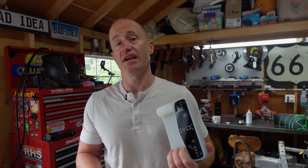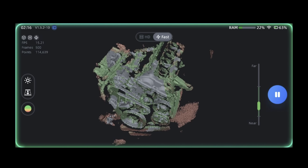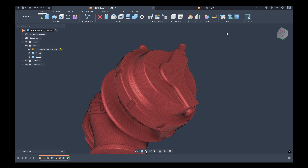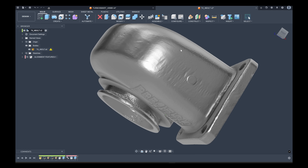The place where the Vega absolutely excels is in its sheer convenience and ease of use. I went into this expecting an all-in-one to be a bit of a toy, but it's really crazy how simple this thing is to use and how fast it works. If you're coming from a classic Einstar and used to it taking multiple hours to mesh a lot of data, this thing will process even the largest scans in less than typically half an hour. The other really impressive thing is how well it tracks, particularly even without markers in fast mode — if you have anything with a high number of unique features, it very rarely loses tracking. The fact that you can just turn the scanner on, capture the data, and not drag your laptop or be tethered to cables is extraordinarily convenient. I'm working with somebody on a side project who purchased a Vega and had never used a 3D scanner before, and the first two scans he sent me were absolutely perfect in terms of having the detail and features I needed to interface with the part I was designing.